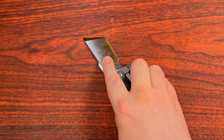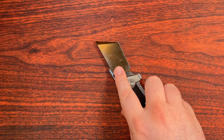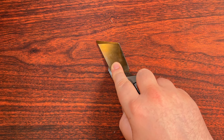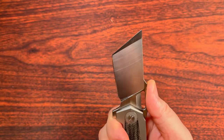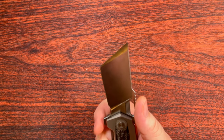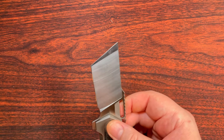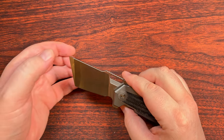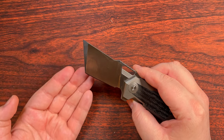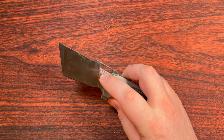You can actually feel when putting it on a stone first — before you try to do that with leather that has a little bit of give — exactly where it meets. Then you can pull that back and strop it. Or you could immediately change it into a V-edge by doing some other sharpening on it. You're going to want a pretty steep angle to not try to fight through so much thickness. It is really strange to have a Scandi grind for the front part of a knife and then a standard V-edge for the standard portion there.